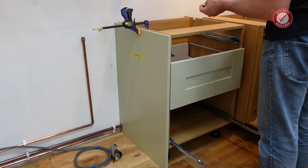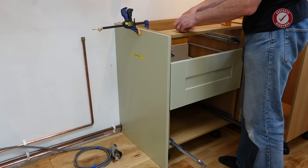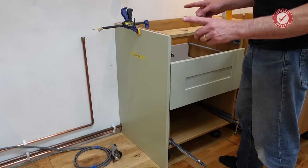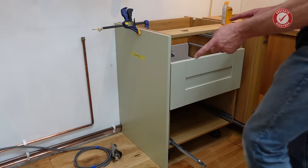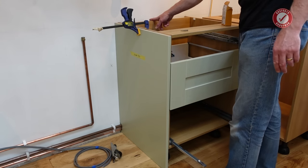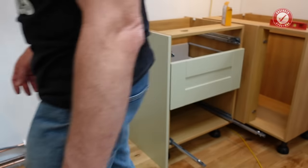I am running very short on 30mm screws. You're going to need a selection of different size screws for all of this, by the way. I'm using 30mm for attaching the end panels on, and also some 20mm, 25mm screws for some bits and 16mm screws for other bits as well. You need really long screws if you're going to go through space plugs into dot and dab at the back. I've completely run out of really long screws, which is a bit annoying.